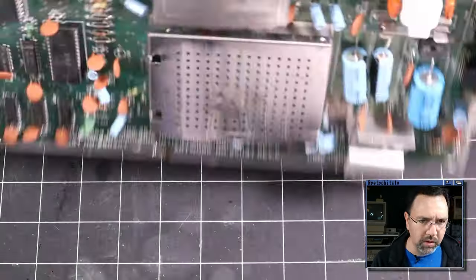And as before, I'll just clean up my desoldering here, just make sure these holes are nice. Came out real clean. All right, same as last time, I've got my Evo 64 out here. We're gonna use this to test the CPU because it's got ZIF sockets, which makes it really easy just to take out the good CPU and put the one we're about to test in.